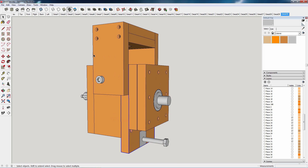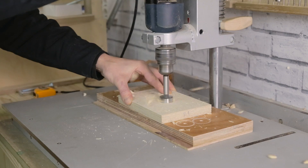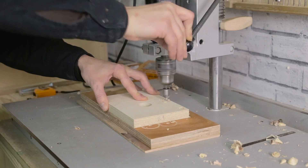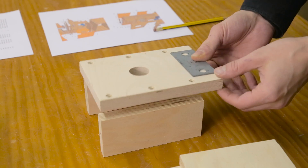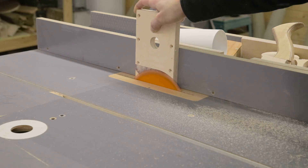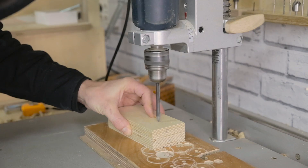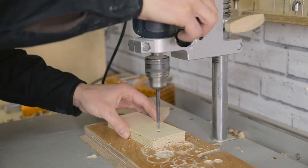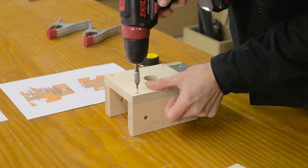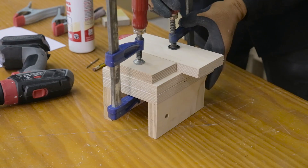This is the upper wheel's lifting and tilting system. After cutting all the parts, I mark and machine a hole for the wheel's calibrated rod. I'll attach this metal plate to the rear where the screw that regulates the tilt will rotate. I drill holes for the screws that will act as rotation axes and screw them together. I attach this other part that will allow us to separate the upper bearings a little bit more.